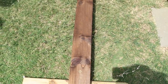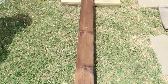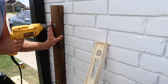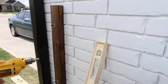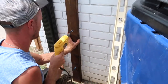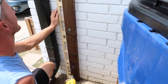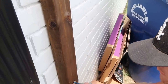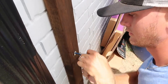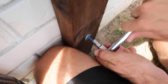Here is what the board looks like now with all three pilot holes in it. It's as easy as lining up the hole on the board with the hole on the brick and screwing in. Screwing into concrete or brick isn't easy, so you have to do things to help yourself out. We obviously didn't want multiple holes in our brick, so we wanted to get it right the first time — and it worked out perfectly, with zero issues. It's definitely worth the extra effort.